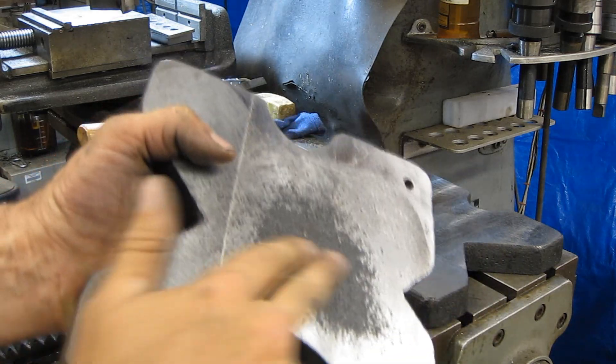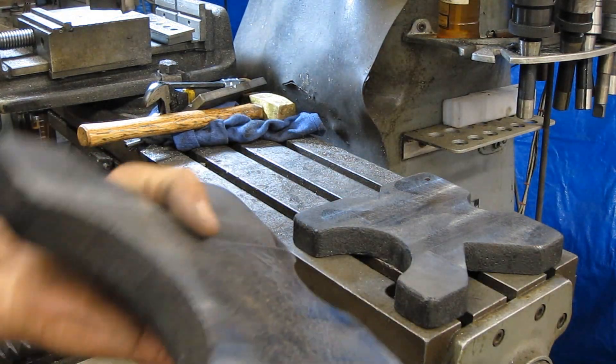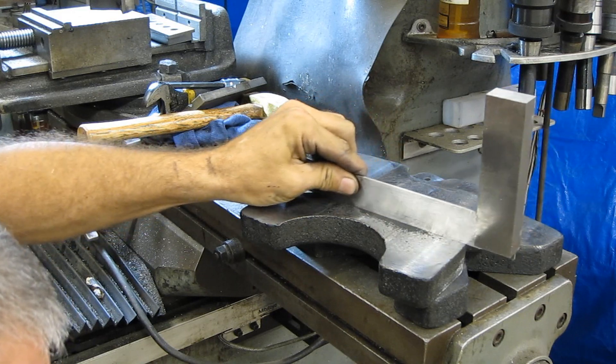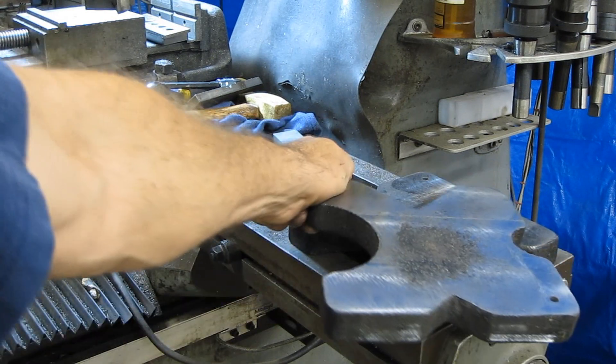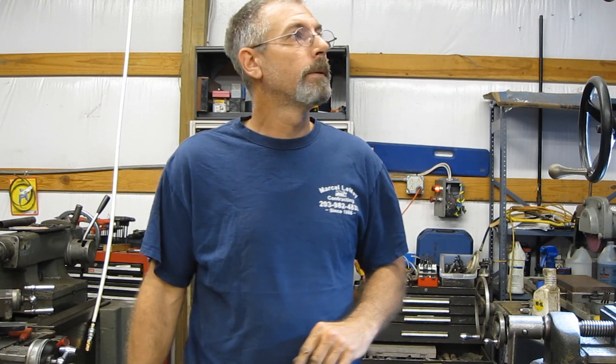This is going to sit so much better on those channel irons on that Harbor Freight press. Over here we've got a little hollow, but it's not real bad — it's scraped just a little bit in this area. Put a straight edge on it — yeah, it's maybe a couple, two to three thousandths low. That's good enough for what we're doing here. We're not building rockets; we're just trying to get something that's usable. Well, I hope you guys enjoyed this video. I think I'm going to do a little feature on the mods I did to the Harbor Freight press — stay tuned for that, because I did a lot of modifications that really make it so much more useful. Thanks for watching.